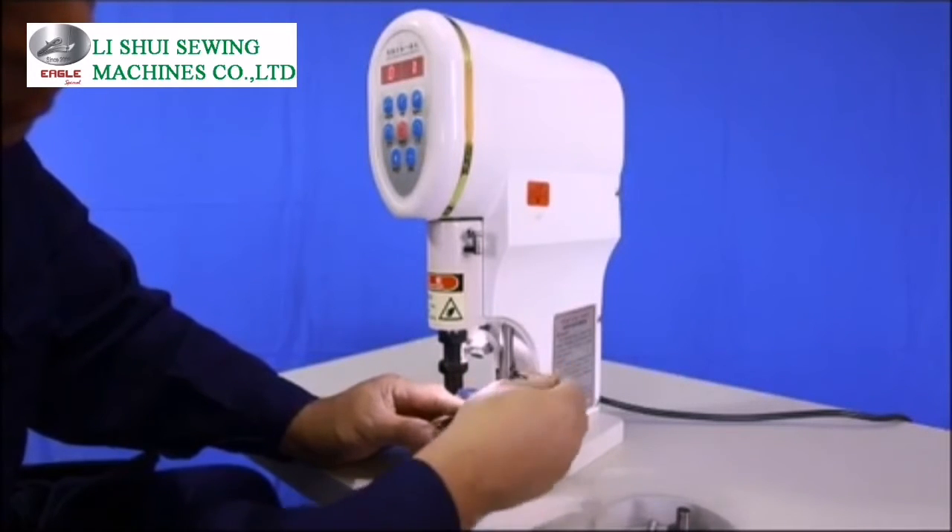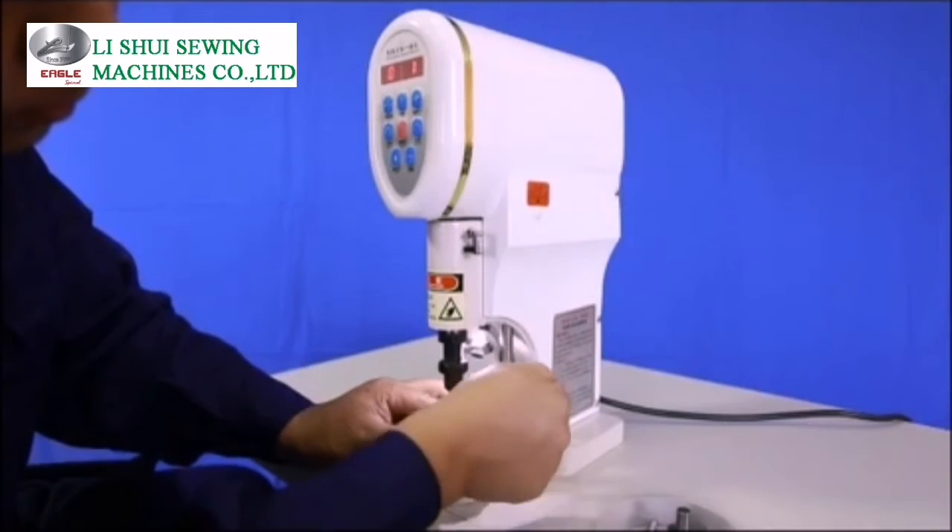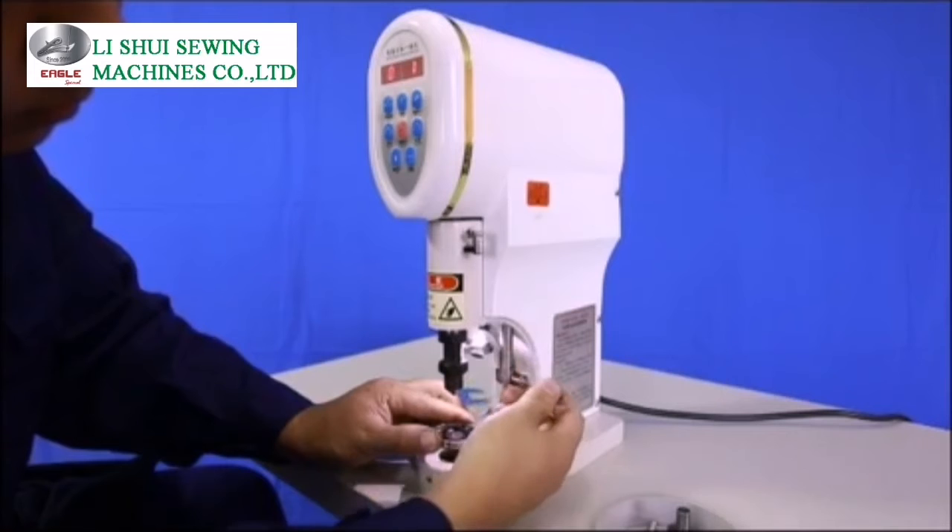After that, adjust the upper ring height to the position when the upper ring touches the working plug on the die. Fix the upper die and release the pedal. Please have a try to punch the button and adjust the upper die to the right position.